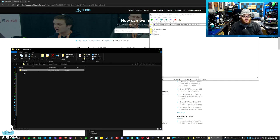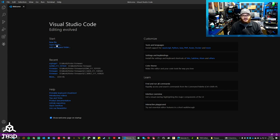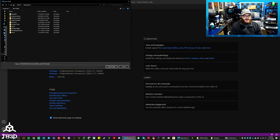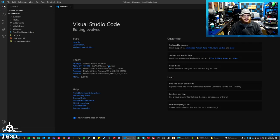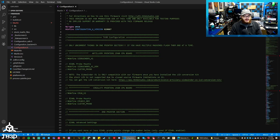You have to open the actual folder called 'firmware.' I like to go into this folder, copy the path, and launch VS Code. Now that VS Code is loaded up — assuming you've set it up per our installation materials for compiling firmware — all we have to do is hit 'Open Folder,' paste in the directory, hit enter, and then select folder. Click the little arrow to expand and double-click 'configuration.h' and you'll get a window with all the text. Since I'm dealing with the Sidewinder X1, I want to delete the two slashes in front of the defined Sidewinder X1, and also uncomment the OEM EZABL mount line. This is all you need to do to get it running.